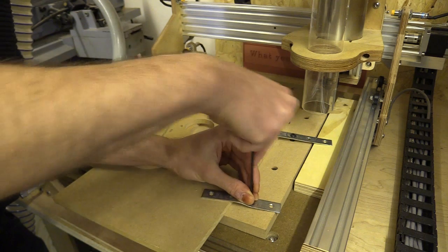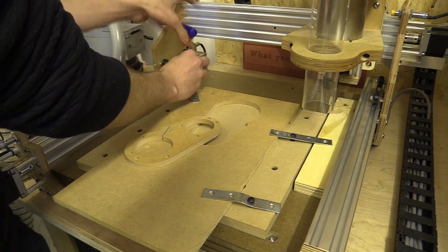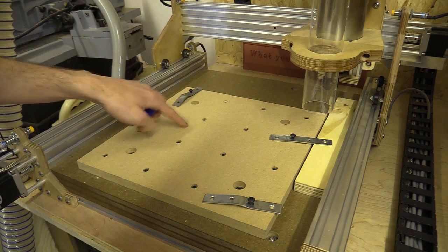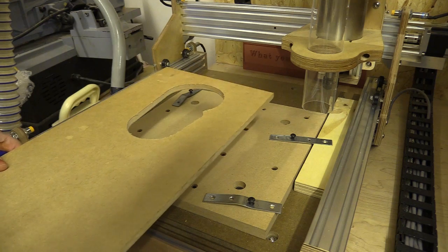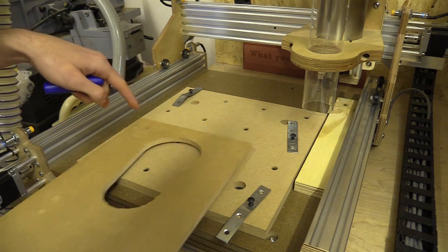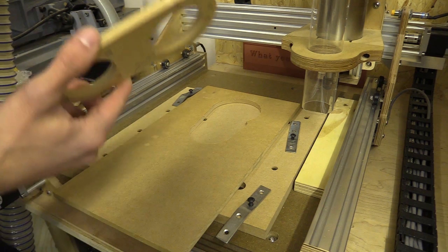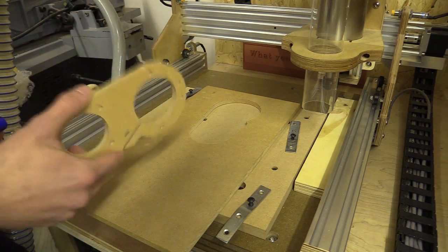And the thing that I suspect — and I'm just going to double check this now — barely went through to the waste board. This measured as 9.12mm, I set that in the software, and it did not cut into the waste board at all. It's so accurate. I can't believe I've built a machine with birch ply plates and it cuts better than the bloody X-carve.